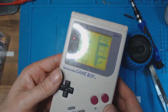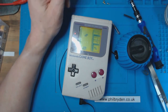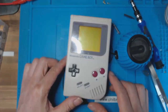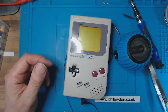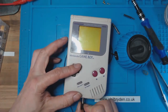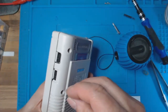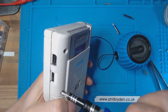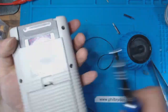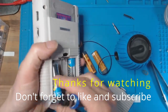So, 95% finished — just missing the replacement speaker. I'm going to call that a day on this one. This has been the most challenging, hardest project I think I've done so far. Not because the Game Boy is terribly difficult to work on, but the corrosion that it suffered from meant every time I soldered a wire or tried to fix a trace, as I was fixing one part something else was falling off, and it made it very difficult. There are multiple trace repairs and parts where the traces have just gone completely, so we've had to jump to the next available component. I never want to work on a corroded system again — it has been a complete nightmare. But I'm glad it's finished. Almost — just need a new speaker. I hope you have enjoyed the video, thank you.